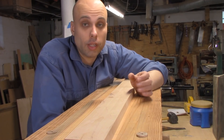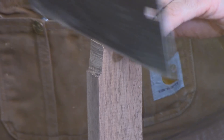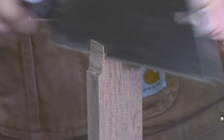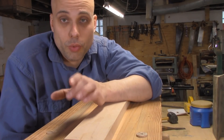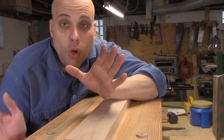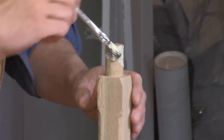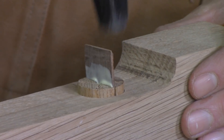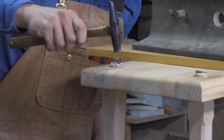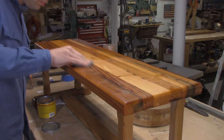The procedure is very simple. I'm going to take a contrasting hardwood — I like walnut because it looks cool — and cut eight thin wedges that taper down to nothing at the narrow end and only about an eighth of an inch at the striking end. When I slit the tenons, I have to make sure I'm doing it in the right direction. If I slit and wedge the tenon along the direction of the grain of the top, I'm going to split the whole thing right apart. So the wedges have to be perpendicular to the top. When I glue the whole thing up, I spread glue on all the surfaces, assemble the piece, pound in the wedges — and I'm not even going to need any clamps because that wedging action provides all the clamping force I could ask for. Then I flush cut all the tenons, sand, and finish the piece.